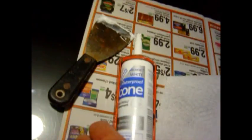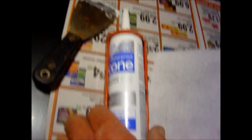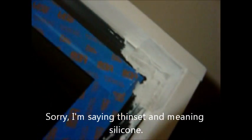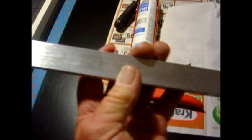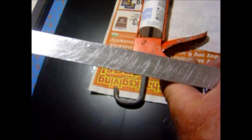Number one silicone is what I'm using. Put that under it, press it down, and work it with a flat trowel until it looks similar to this — it's worked in. The thin set has worked in there and reinforces that corner. The rest will be a good bond all along here. I've sanded the back of what's going to be glued with the silicone, roughed it up, and cleaned it off with lacquer thinner. That'll go on top all the way around — it's framed in.